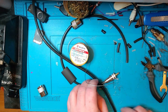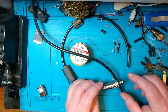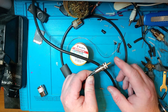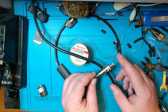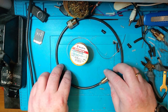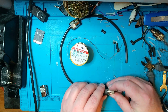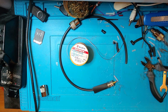We're just going to check that it's relatively straight and hasn't melted — it hasn't, so we're good. The smart thing here is to make sure that you don't have any solder blobs on the outside, because if you do you're going to have a problem getting this connector inside an SO239. So let's go ahead and put some heat shrink on — that's basically because I like my cables to look relatively nice.